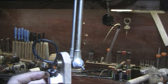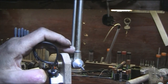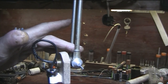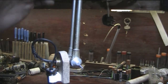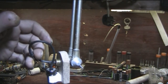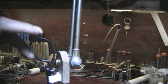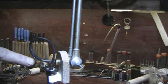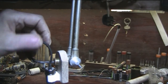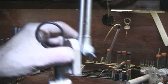With the recent upgrade to my desk lighting — which I featured in a recent video — I originally had an angle poise lamp, and I got to thinking I might as well reuse the angle poise arm for this camera. I ran a new cable up inside it, which was a bit of a job as the cable was really stuck and I had to use a long drill to pull it through. I've put a splice in there because I didn't want a lot of cable hanging out, since these door cams come with a fair amount of cable. I've spliced it into the cable running up the stem of the angle poise, so I can move the camera wherever I want over the desk.